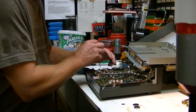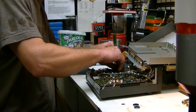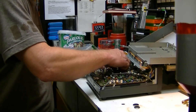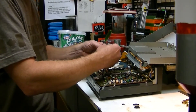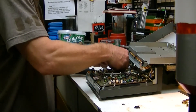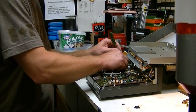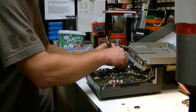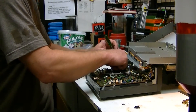Just get a little screwdriver. I have to lift this up so the battery slides out, and I am just going to push on the back of the cell so it comes out. The old coin back button cell — positive side up. Push the next one in, make sure that is back down. Same process: pull that out and get the second battery out.